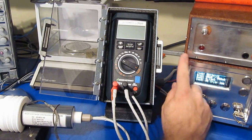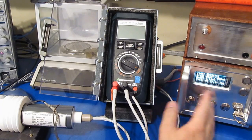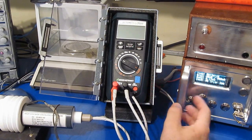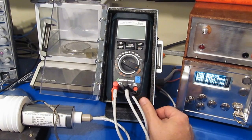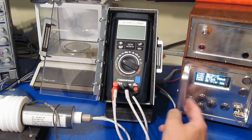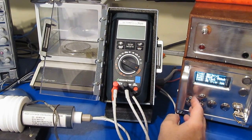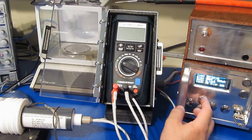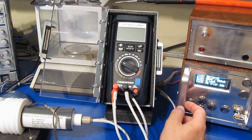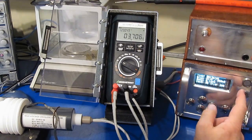This will be 5 transients, 2 ohm source, 1000 volts peak, with a 100 microsecond full width half height. There is a major difference between the IEC standards and what I'm doing here - I'm not trying to surge test these meters for safety. The goal of these tests has always been just to look at the robustness of the meter's front ends. This transient generator is capable of putting out a maximum of about 20 joules on the high side, and I'm applying a 100 microsecond full width half height where the IEC standard calls out a 50 microsecond full width half height.